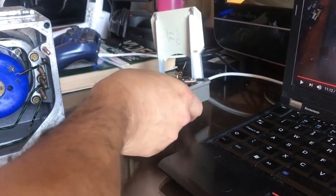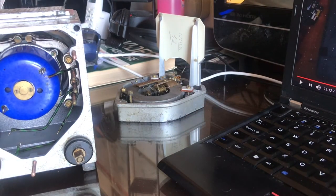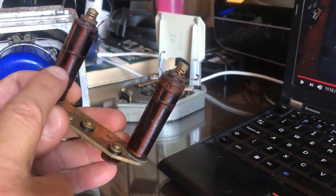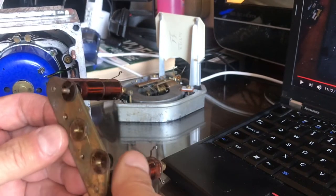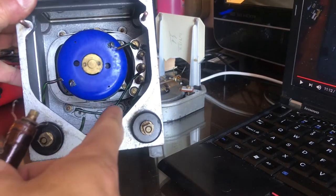The difference is here: I have two 100K resistors. One is open, the other one is about 10 Megaohm. So they are way off and broken. It was inside there - that's the screws.